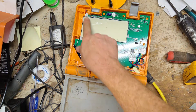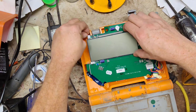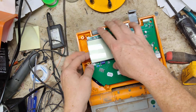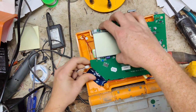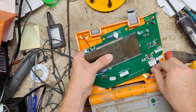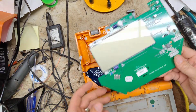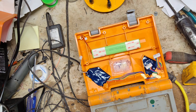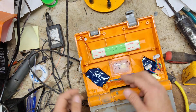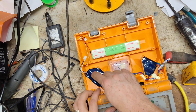Alright, the battery hides up in this upper left corner. So the first thing I do is unplug it, that way there's no stray voltage running through the thing. And then we'll take the battery charge cable out, and then unplug these two wires here. It's going to wiggle and pull. These are what go to your connectors on the side of the scale. And there's your battery. There's your little silica things to keep moisture out of it. And you can see the connectors and the charge cable are in this big hard block of epoxy.